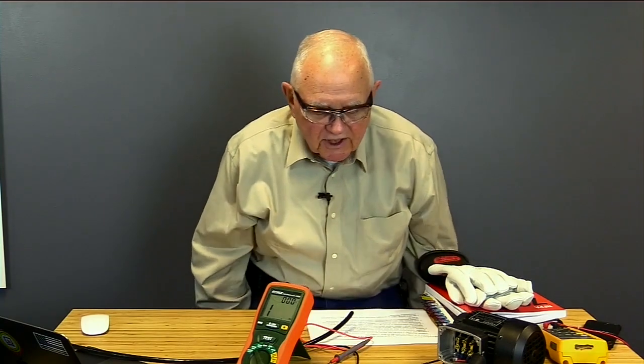So anyway, that is insulation resistance testing in a nutshell. That is the simplest test. If you want to learn more about polarization index and dielectric absorption ratio and high potential testing and all of these other types of insulation resistance tests, which are very valuable for troubleshooting, acceptance testing, and so forth, then go to the members portal on ECMweb.com and look under that members content, and you will find several good articles just recently, within the last few months, on insulation resistance testing.